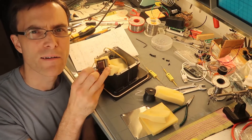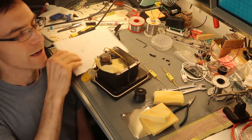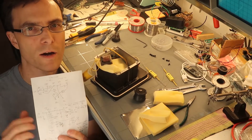There's also a little tiny transformer in there. Do you think that can handle a lot of power? I don't think so. So I've got a better inductor here — a lot heavier, a lot beefier. And I've got my schematic here; it's basically the same except we're pulling out the L-pad and just going to bypass it completely.